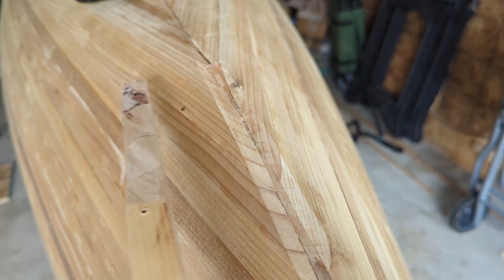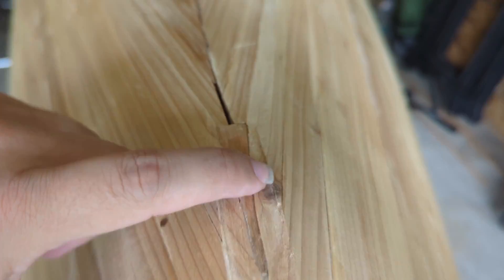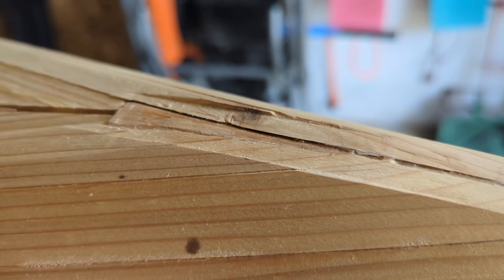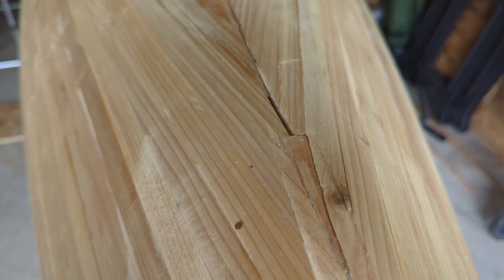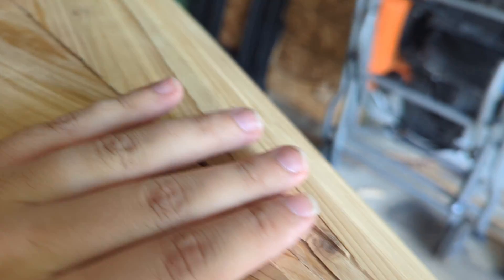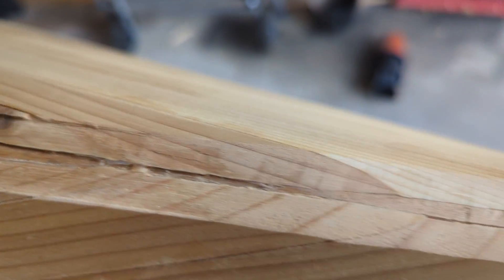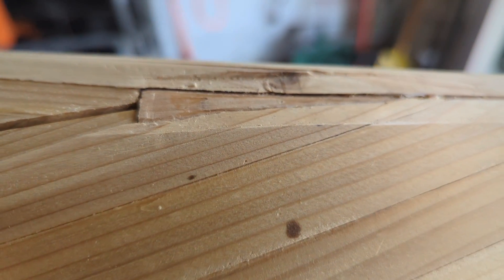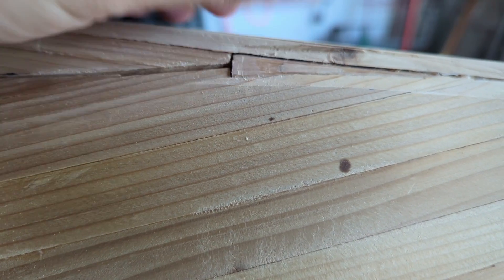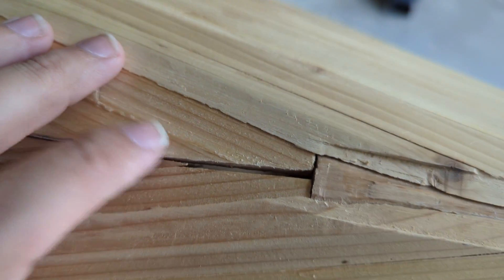The only other fine detail is I did cut in a little bit of a channel here. From the side you can kind of see what's going on — it's not very deep. If you see a lot of other canoe build videos, these channels are often very deep. Mine's pretty shallow, and part of that is just setting a curve that matches what I already have on the outer stem. I don't want to make a lot of huge changes. The way these strips kind of butt up against the inner stem, I only need to get down to that level because you want the outer stem to be glued to the inner stem. I wanted to make sure I had the inner stem fully exposed, so I just cut enough of a channel that I could fill. There are some gaps where it didn't glue very well from the wall to the inner stem, so I'll be able to fill that space with a little bit of thickened epoxy, and that'll hold everything together.